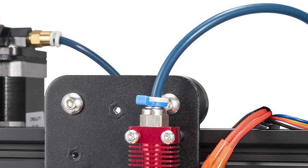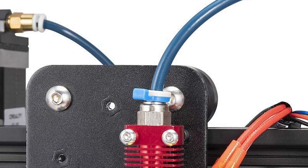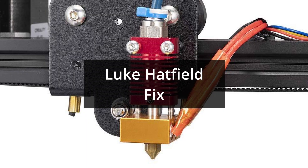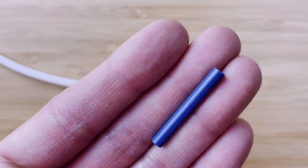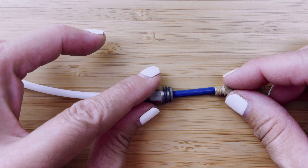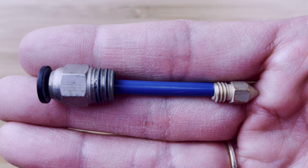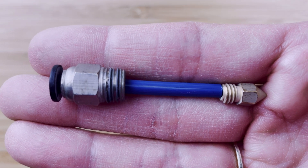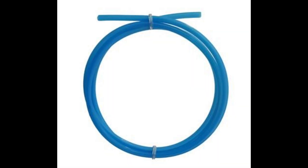Unfortunately, how the PTFE is attached to the hotend can cause issues. A simple solution to this problem was proposed by Luke Hatfield. The Luke Hatfield technique uses a high-temperature insert inside the hotend that is flushed against the nozzle and decouples the insert from the main PTFE tubing. With this change, the insert is guaranteed to be flushed against the nozzle and reduces clogs within the hotend. We suggest you use Capricorn tubing for the insert.